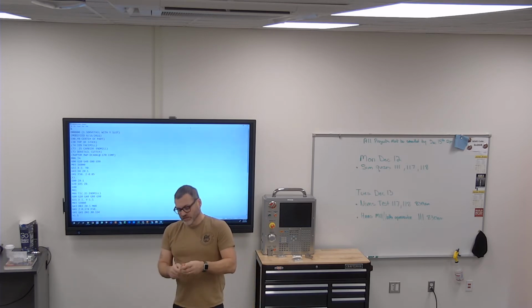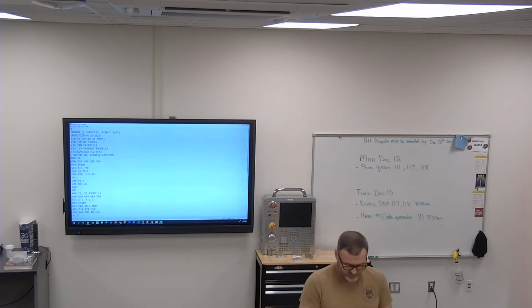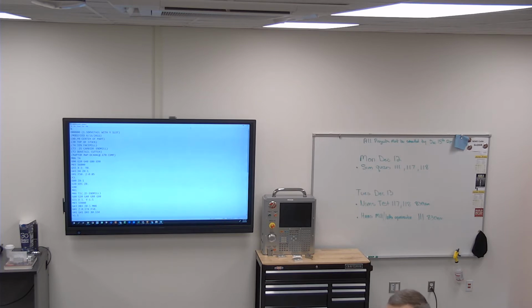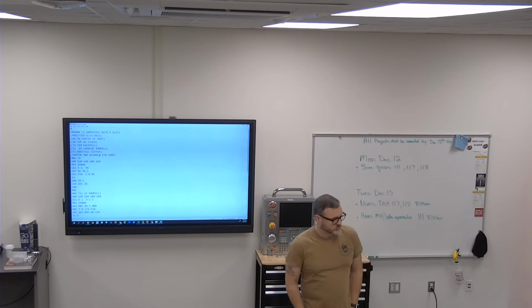So I've got these end mills to use. These are carbides. And then the 1/4 inch end mill, I don't really care if it's a carbide or not that you use, but I have carbides for you to use. When we put it in there, we're going to put it in just like that and then run the other side? No, you're going to be running this in a vise today. You're just prepping parts for future usage. So that's what we're going to make, and we're going to make sure it's to tolerance.